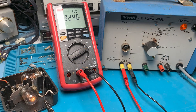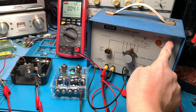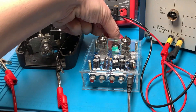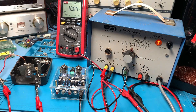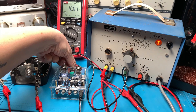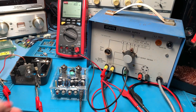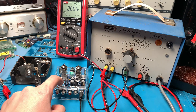So let's give it its first ever power on and see what happens. Are we ready for this? Switching on the mains. Okay power's going in at 13.9 volts. Let's turn it on. A little glow from the bulbs as the caps charge up for the first time. There we go, we've got our little glow from the LEDs. It's not too OTT - there's a little bit of flicker on the camera, that's just the camera picking that up, they're not flickering to my eyes. Lovely. First test - turn that off. Now we know we can do away with the dim bulb limiter. So we're going to hook it up to the signal generator and the scope, put a signal in and see what's going in and what's coming out. Then we'll try and put some music through it.